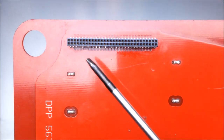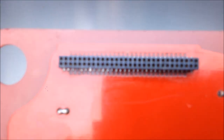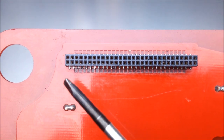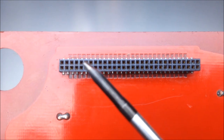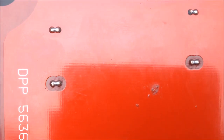If you look very closely you'll notice that each one of these wires are actually tied together. You'll notice that the ground plane connects to every single one of these pins, which means that this whole pin header here is actually the ground plane for this circuit board.